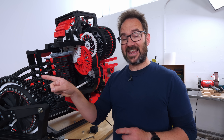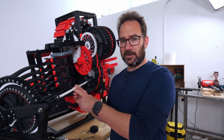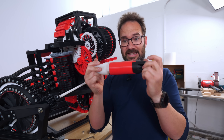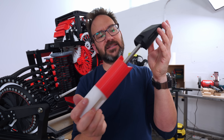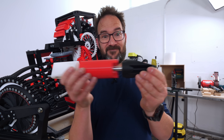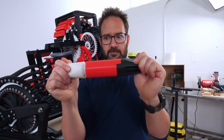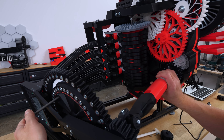Speaking of breaking — this is directly connected to the motor through this shafting here. So if anything gets stuck on the display or on the wheels, and this doesn't break, it will explode. So I made this clutch that will release if something gets stuck and will let me reset it quite easily. It's just a nylon part with a 12 mm steel shaft. There is a hexagonal coupling between the nylon part and the red part, and then I printed these two parts in here with two magnets embedded in them, so they just try to get against each other, and when you apply too much torque it releases — hopefully avoiding lots of pain, and marbles, and plastic everywhere. Just to test it — if I block the gear from spinning, the clutch releases, avoiding mayhem.